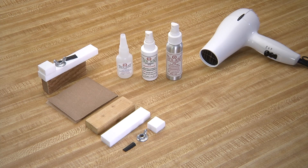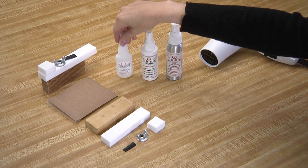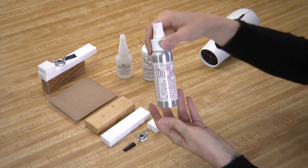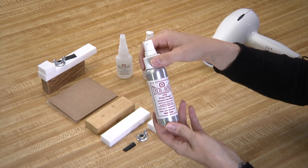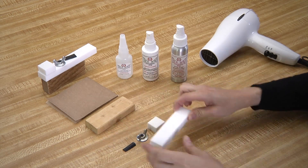We're going to show you how to bond anything to Teflon — we will bond Teflon, metal, rubber, and wood to Teflon, just as we showed you here. To do this, we will use the basic poly kit, which includes a structural adhesive (usually our SI blue), our activator accelerator (which helps generate the chemical reaction necessary to get a bond), our poly prep (a surface primer and adhesion promoter for poly plastics and other polymers), as well as a step-by-step instruction sheet. For our first example, we'll do Teflon to Teflon.